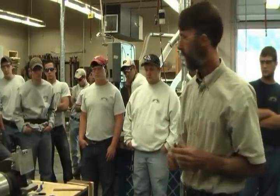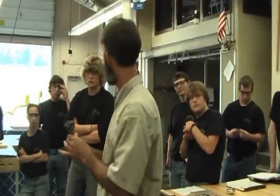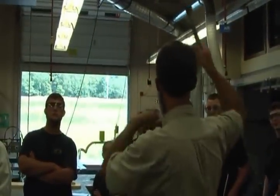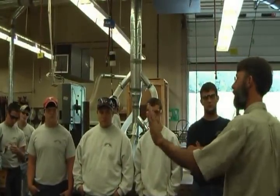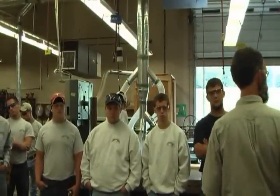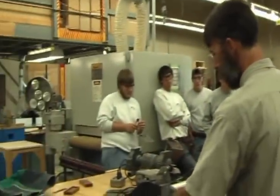What is that tool beside the grinder there? This one? Yeah. Perfect question. Well timed. We didn't set it up. What's this tool? Have we ever seen one of these before? Wheel dresser. Right? Wheel dresser. You come in, some yahoo's been grinding on your stone and it's all bellied in the center. This is what re-grinds, dresses the stone for you. It takes some pressure. Somewhat aggressive with it. This one's bolted down, so I'll dress it. How's it look for condition anyway? I can feel it.